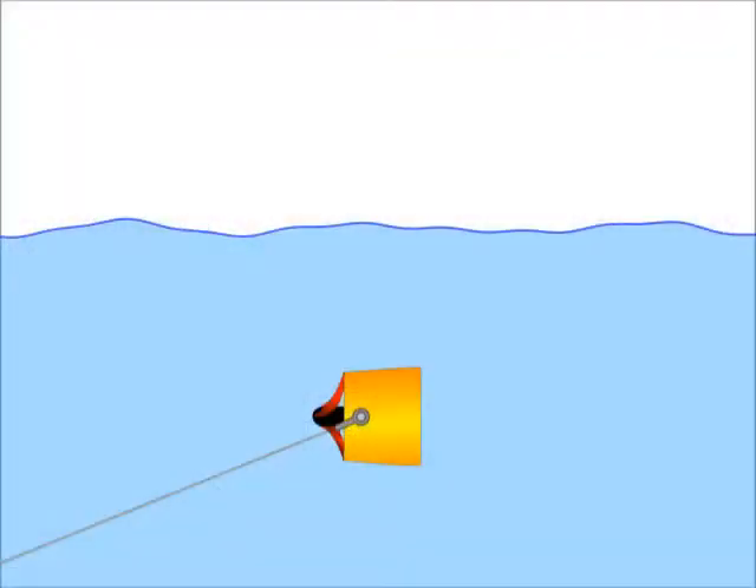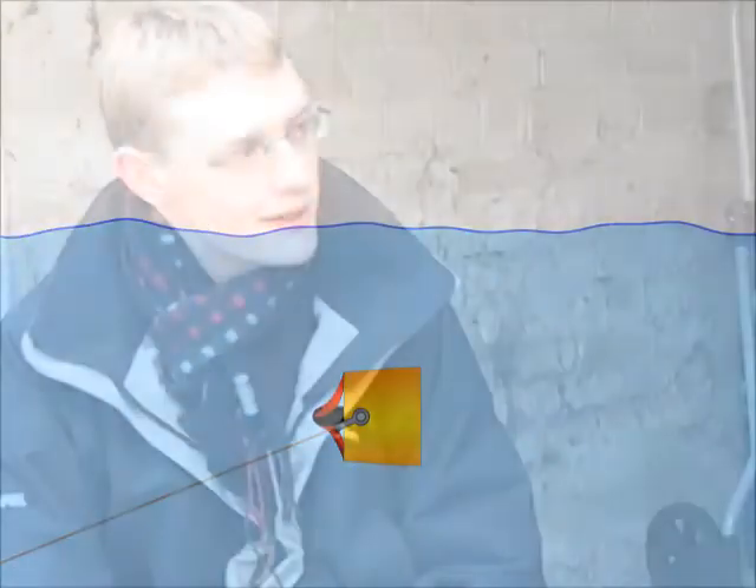Even with a strong device, if you get hit by something really large that's a challenge. We're looking to design our turbine so that it actually absorbs impact rather than trying to resist it. It's also moveable, so it can tend to move out of the way if hit by a large object. Rather than rigidly attaching it to the sea floor, it's based on a series of tethering lines down to the seabed.